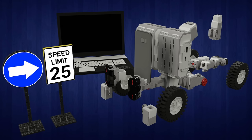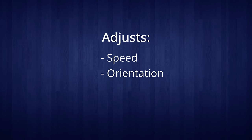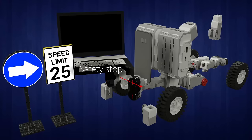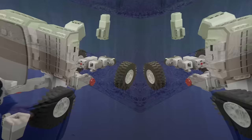Here's a quick summary of all functions. It can read text and recognize arrows using the camera, making it adjust speed, orientation, and precision. It's also capable of parking automatically, since it centers itself according to the drop-off sign. The infrared sensors make it slow down and stop, and the ultrasonic sensor makes it speed up if possible. The color sensors allow small orientation adjustments by looking at the lines. The gyro sensor makes it always drive in the right direction. The robot arm can automatically pick up and drop off a box, and all decisions are made by the code running on the laptop. The code is now done — we can test it!